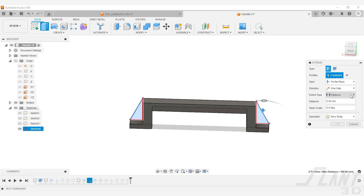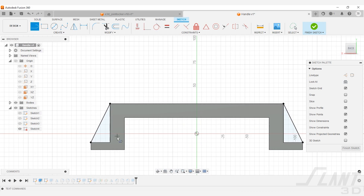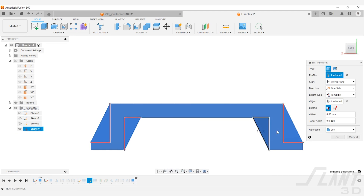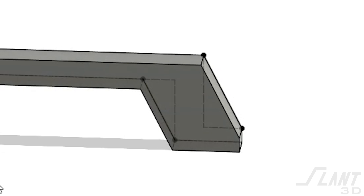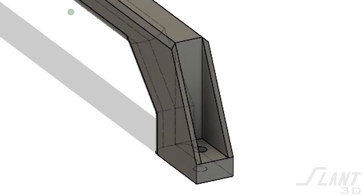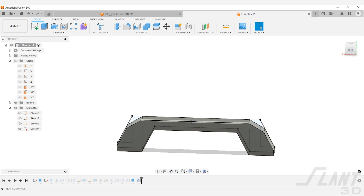This handle is printed on its side, so we have all the layer lines in the right direction for maximum strength. We're making sure the holes don't pull out — so why have ribs when you can fill in all the area around them? There's no worry about shrinkage of material or warping. Use all of the enclosed volume that you can, because you can add more material there to reinforce the part. You're also getting rid of those large cavities left by the ribs. Ribs are really a last-century solution limited by traditional tooling — 3D printing doesn't have those limitations, so use that space, that material, that volume.